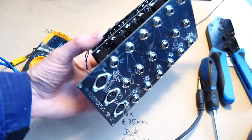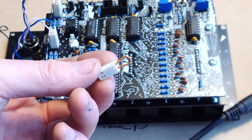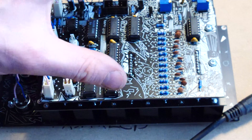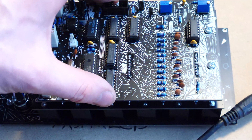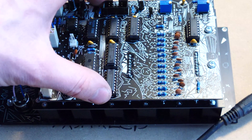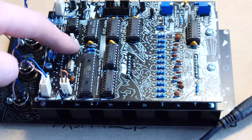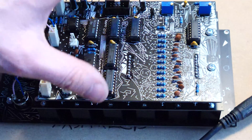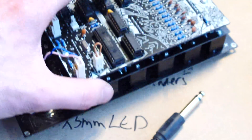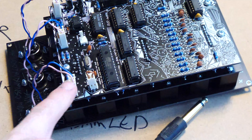Before plugging it in, you can either solder the two chain pins together or make a little connector. These are for when you want to chain two modules together so they handshake, enabling up to 12-note polyphony, MIDI channels 1 to 8 or even 1 to 12 with three modules. With four chained together you can control all 16 MIDI channels. If you only have one module, make sure the chain input is daisy-chained together.